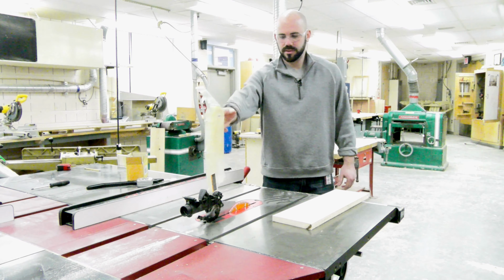Enter that 5-inch mark. I keep holding the board with my left hand. I do not let go of the board. Grab my push stick. Push stick pushes through. Left hand plants. I get this board all the way through. It exits the saw. Push stick gets put back. Saw gets turned off. Now, what's critical is you must wait for this saw to come to a complete stop.